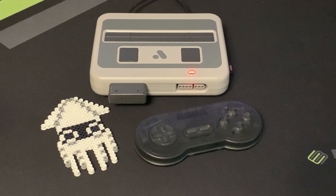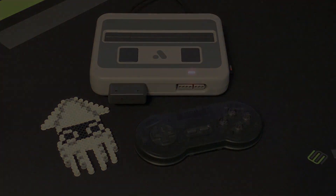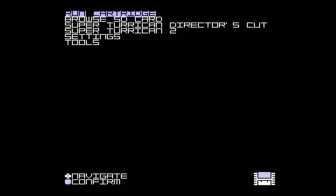As the flashing process nears its completion, there will be a pause on the LED, followed by the HDMI signal of the Super NT cutting out. The console will boot back to the main menu once the process is complete.